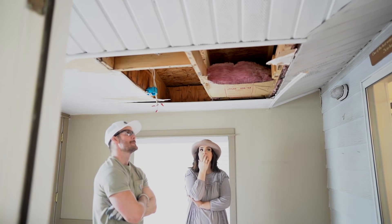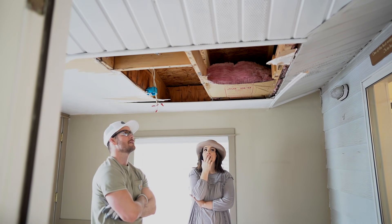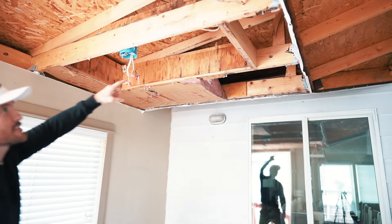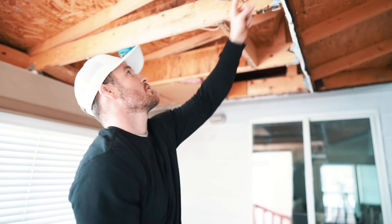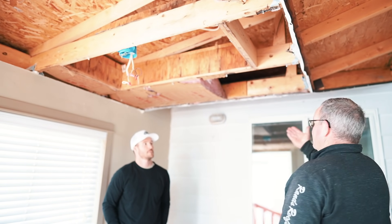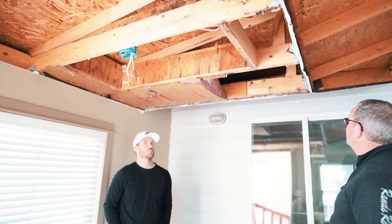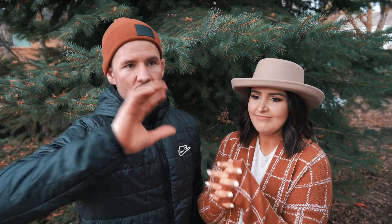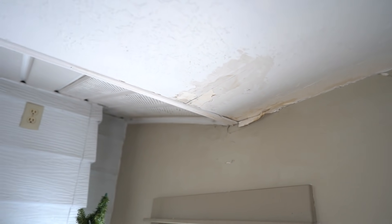Once I got into the roof I realized the issue we were facing — it was probably worst case scenario. The original roof was still there and the new framing to support it had been framed into that original roof. So I needed to call my friend Gary over at Rand's Roofing to find out how to rip all of that out without compromising the structure. Now that Gary has been here I feel a lot more comfortable. I'm going to throw up some two-by-sixes, restructure it, re-support it, and I'll be able to rip all the old roof out that was hiding underneath that drop ceiling.